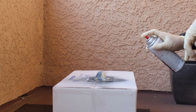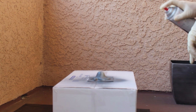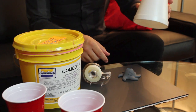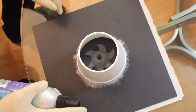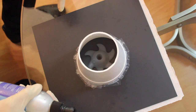So what I do next is spray it with primer. We don't want our molding material forming a bond with the print. We need to sit our 3D print on a flat surface. We need a cup with the top cut off it, and we'll need to tape it to that surface with the print inside. Spray the inside of your cup with mold release. This will allow you to remove your 3D print with ease later on.